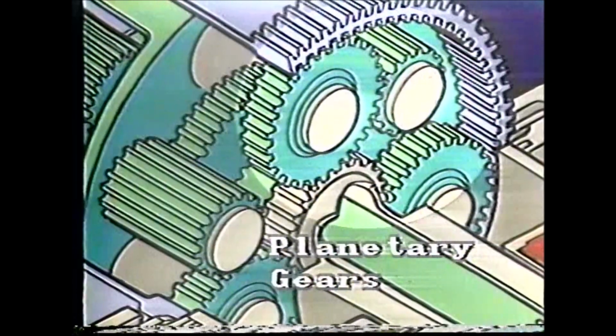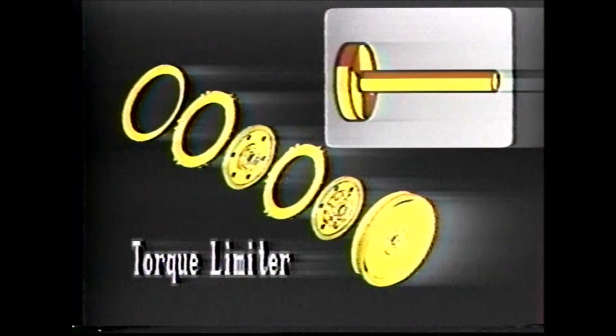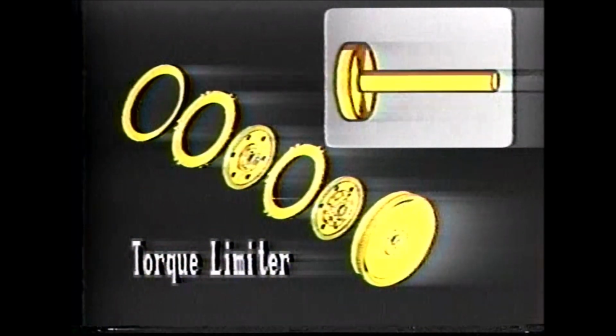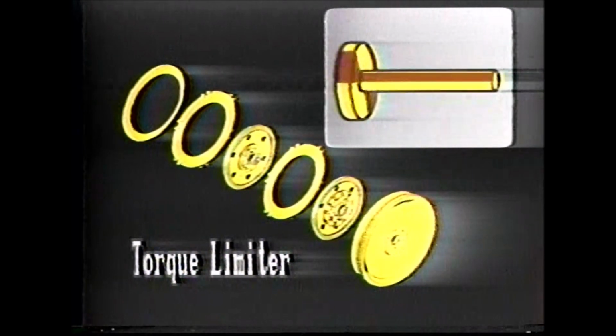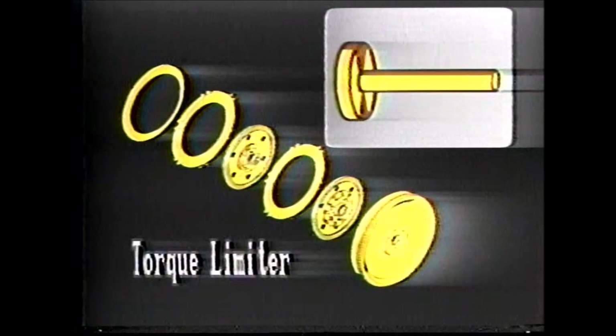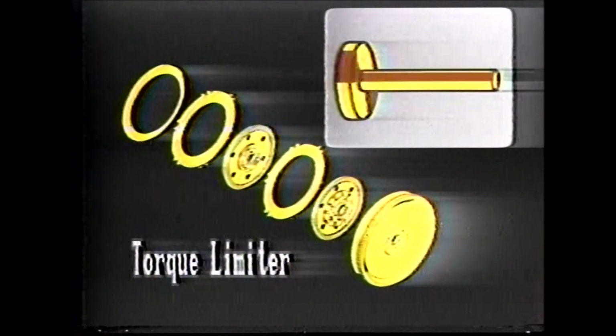To simplify the understanding of the planetary gear design, we're going to build and study the planetary design one gear at a time. We'll start with the input sun gear using a simplified animated drawing. The input sun gear is driven by the engine flywheel through a spring-loaded disc called a torque limiter. The torque limiter protects the drive line from heavy shock loads and vibration.